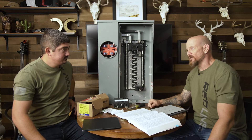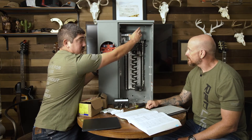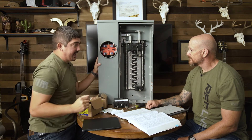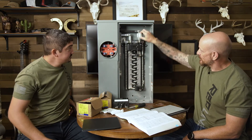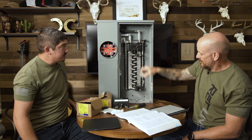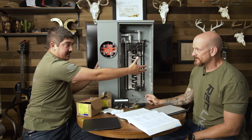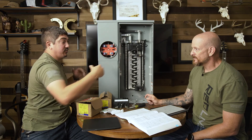What if they wanted more solar than that? For this panel specifically, Square D makes a kit — a line side or supply side tap kit — which makes it so we can feed the solar system in before the breaker, before the bussing, which makes it so we can add a larger solar system. That's just taking these lugs here and putting them on the bus up here. There are additional things we have to do as far as protection — we have to put a disconnect on that side of it with fuses, a fuse disconnect, to protect everything as far as that system goes.